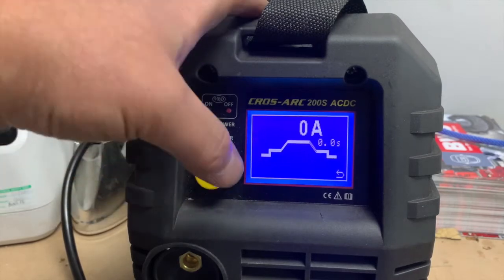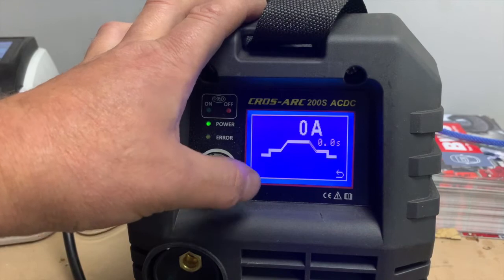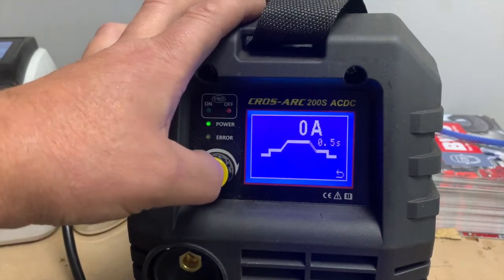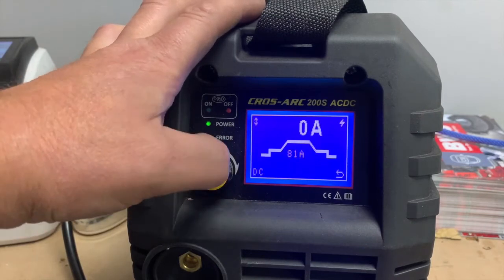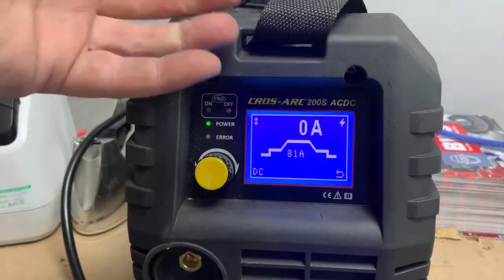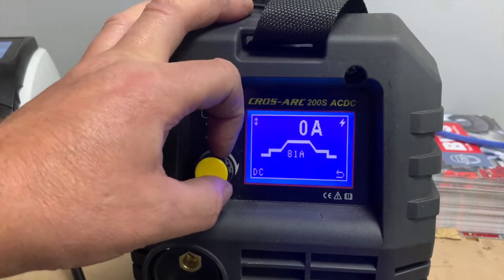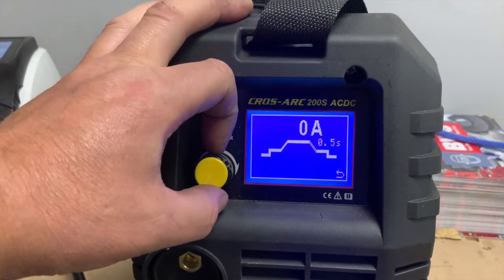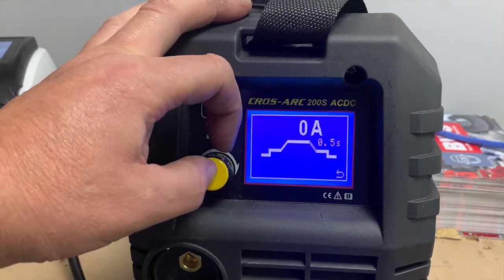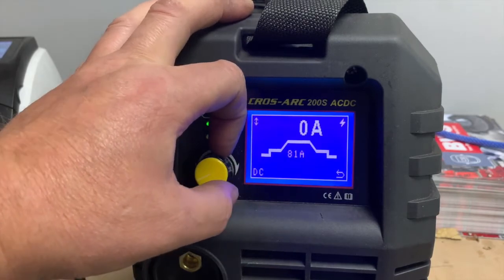So obviously, for instance, if we're welding aluminium, we want the arc to not finish too quickly. So we need to ramp down a little bit. So again, half a second to a second is a very good ramping down time. So we're trying to get the current to gradually decrease, which means that the weld pool is slowly hardening. It's getting solid. This reduces the chances of craters. And then obviously we don't want to just finish at zero amperage, so we're going to finish at 10 amps.